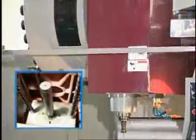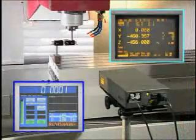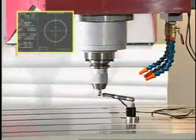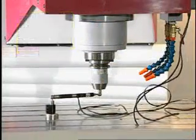The balancing weight operates smoothly and easily for the most accurate results. The three X, Y, and Z axes have been laser calibrated for the most accurate positioning, and a high-precision ball circle is used to match the two moving axes for the most efficient and precision production.